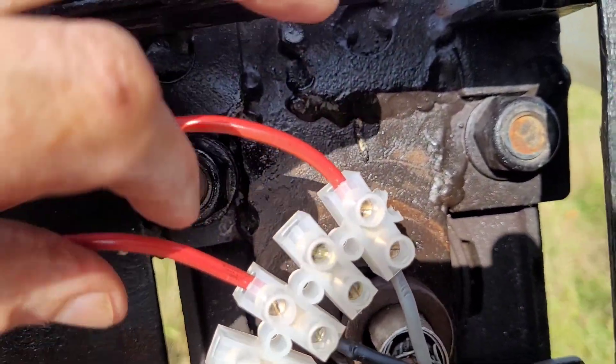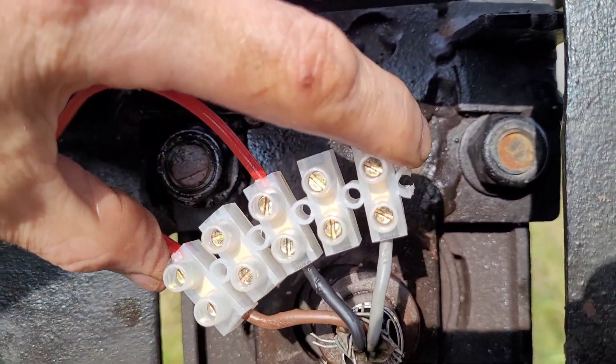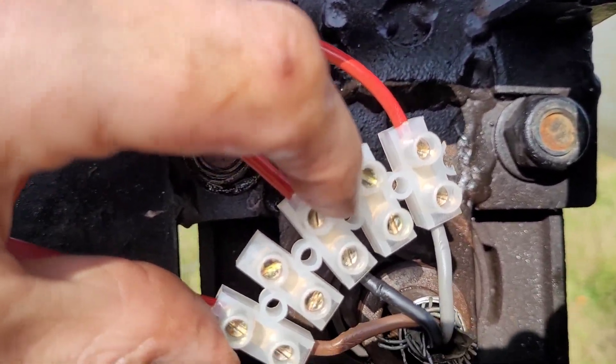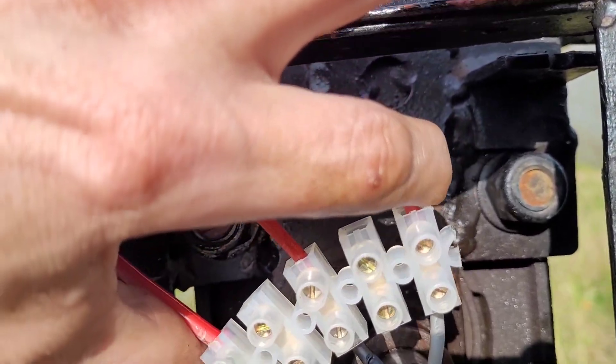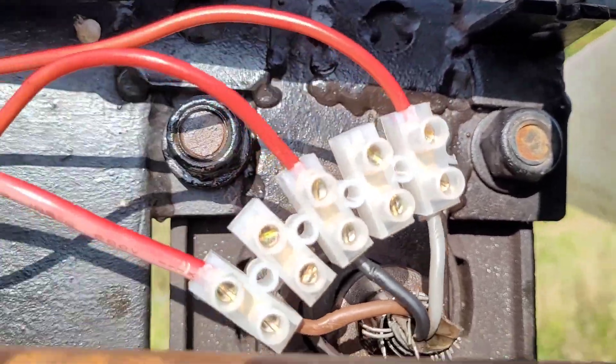So that's the motor side replaced with nice new ones. What I've found is best to do, if you're doing three wires, is to leave five terminals on here. Because if these are too close together — particularly if you're pushing over 30 amps through there — they can basically end up melting together and causing a short. So I'm going to leave it like that.